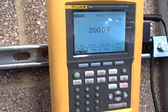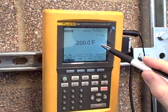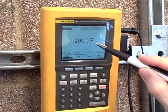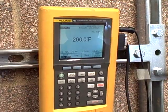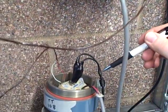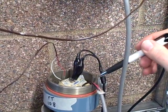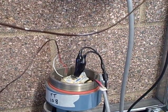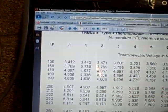The Fluke is aware of this. It's going to calculate the amount of millivoltage based on the table for 200 degrees Fahrenheit — which we saw was 4.907 millivolts — and subtract from that the amount of millivolts that it knows the compensation circuit is generating. Therefore, when it outputs that millivoltage signal and the compensation adds the additional in there, it's going to read 200 degrees Fahrenheit. Let me show you with real numbers how this works. We've already seen 200 degrees Fahrenheit is 4.907 millivolts.